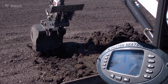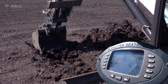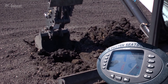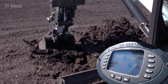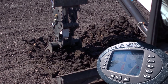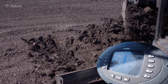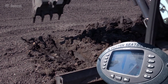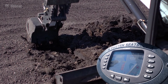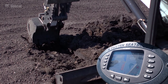I'll be even more careful on this pass. It's telling me my teeth are in fact right at or near target. I'm going to be very careful on the dig now. I'm on a solid tone — that tells me I'm at target. I'm hoping this will be my last pass, so I'll use extra care to follow for the solid tone. For a brief moment I heard a fast chirp. That meant my teeth were slightly beyond target.